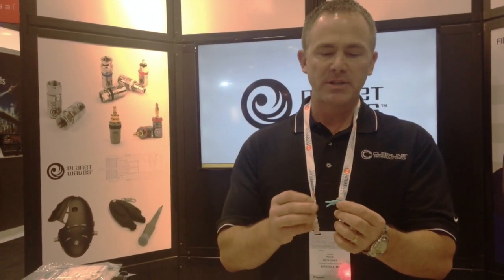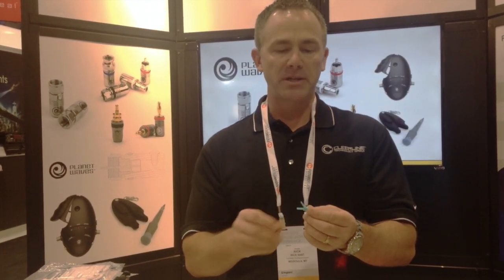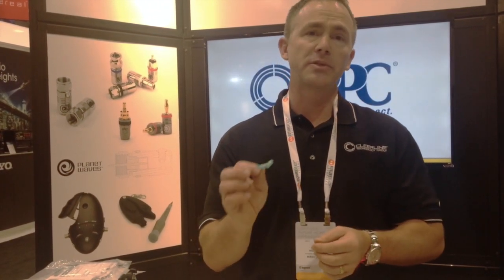Hi, I'm Rick Salem, Clearline Technology Group, at the CEDIA Show 2015. Coupled with our SSF fiber available through Staub, which has 10,000 times the bend and 200 times the pull strength, we've always been shipping our SC connector, but the most common connector in the industry is an LC type. Anytime you're hooking up network gear, it typically requires an LC. This item started shipping in September — same type of hinge as the SC, very easy to terminate. A really neat addition to the line.